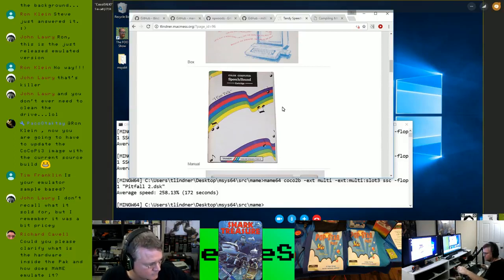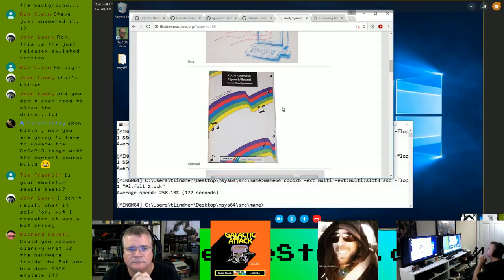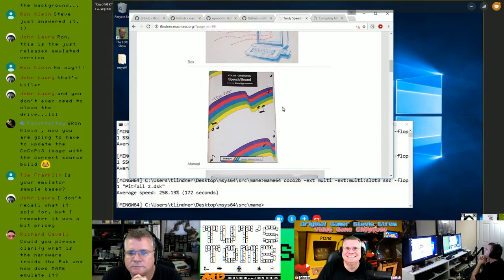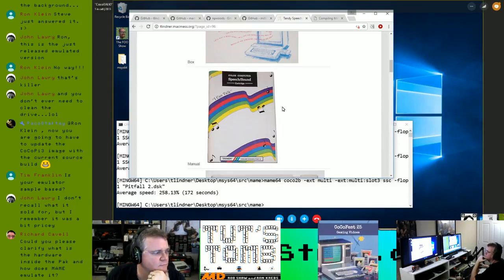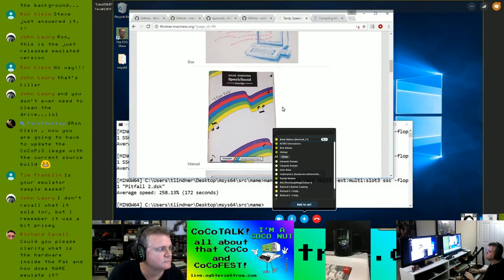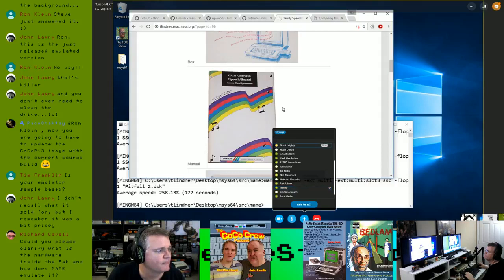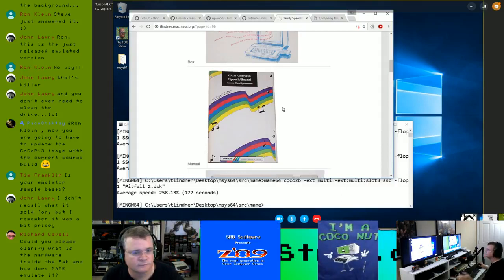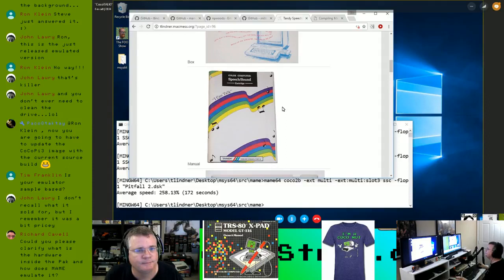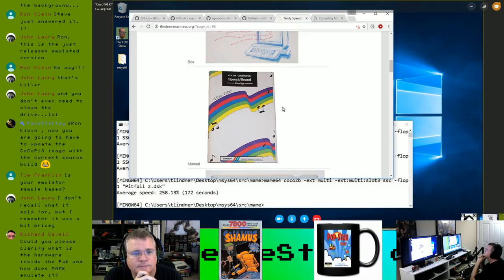I would say yes. The microcontroller was the hardest part, because it was not in MAME when I started, and the people who did the AY chip, the programmable sound generator, had already completed their work, and Joe Zabicek, who did all the reverse engineering on the speech narrator, had completed all of his work as well. And the biggest problem with the microcontroller was the ROM that was inside of it. There are no pins to read out the ROM. It's completely internal, and it also contains its own RAM. So without any pins to poke at to get access to the ROM, we had to do something a little tricky.